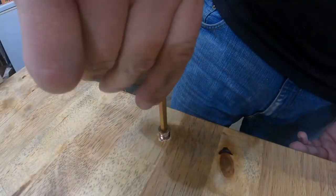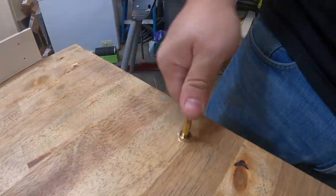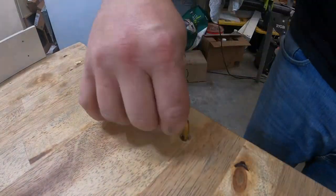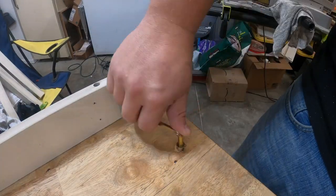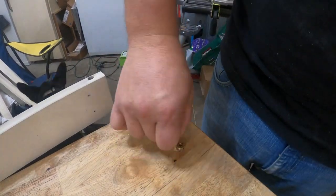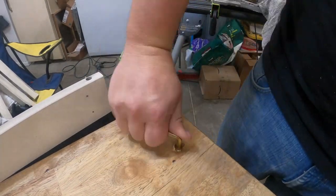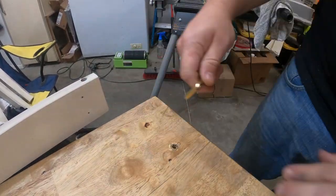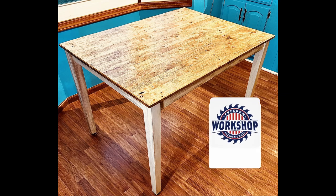That nervousness led me to screwing up and drilling a hole straight through the table. Not once, but twice. To fix those holes, I used some tape to cover one side and filled the other with black epoxy. This kind of mistake is why Rubio is great. I was able to sand down one area of the table and refinish it without having to refinish the whole thing. This mistake also made me learn that I shouldn't use any wood finish until all my hardware holes have been drilled. And once everything was refinished, you couldn't even tell there were holes there.